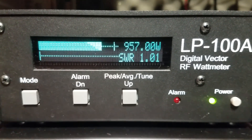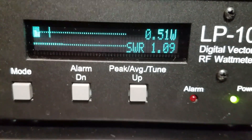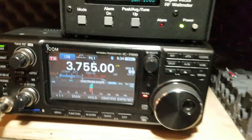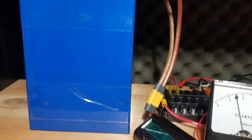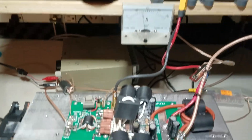That's average power. Now here's the peak power on my LP100 — one kilowatt easily. I'm just not driving the audio hard enough to hit a kilowatt all the time, which is normal. The radio is also powered from 12 volts, and the LP100 is powered from this battery too, so everything — including the kilowatt amplifier — is running off battery.